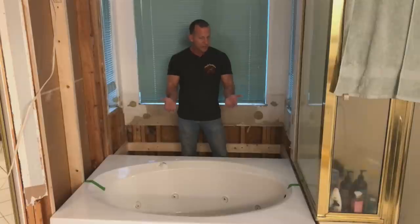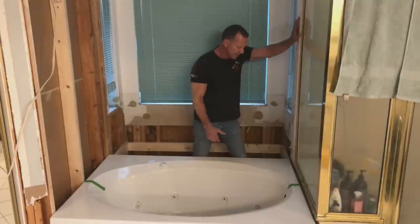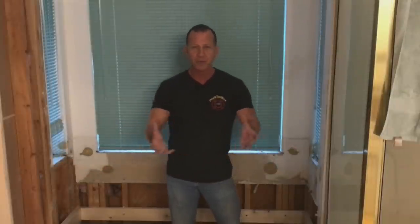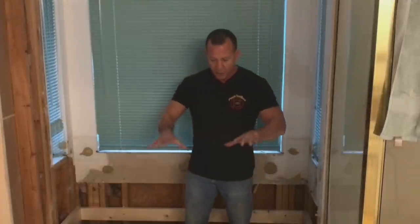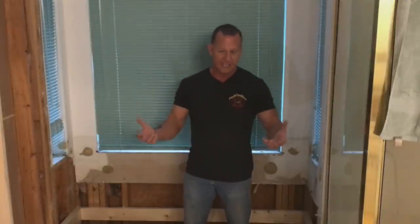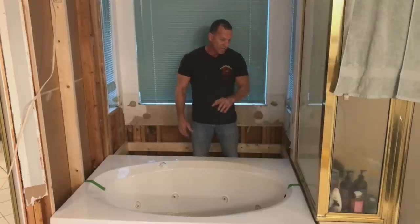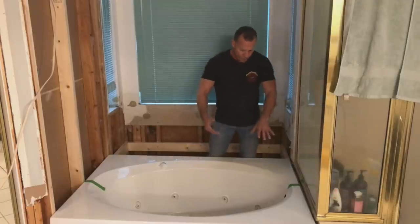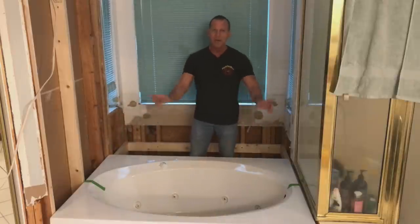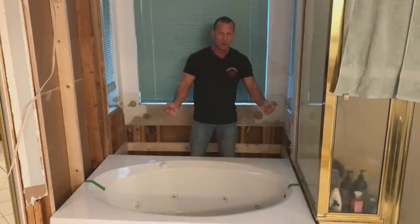You really want to make sure this is level and you want to put some type of bed underneath it to strengthen it up. I'm going to put a mortar bed down here with the frame holding it — a little bit higher than the tub so it sits down and pushes into the mortar bed and conforms to it. I'm going to take a plastic bag, cut it, and put plastic on top of the mortar bed so it doesn't stick to my tub. That way, if I ever need to pull it out, I won't have concrete stuck to the bottom. I retrofitted it to make sure my plumbing lines up, then I put tape on the tub and wall with a line so I can set it back in the exact same spot.